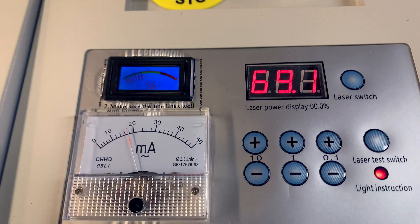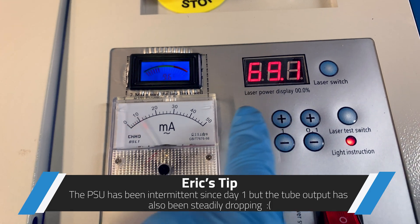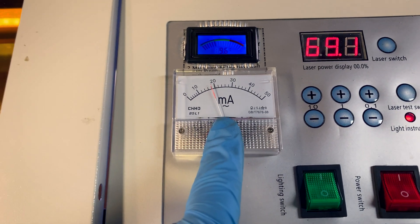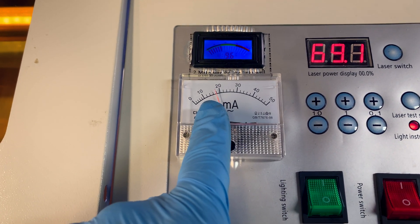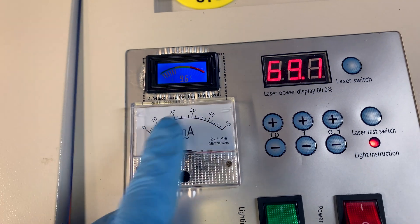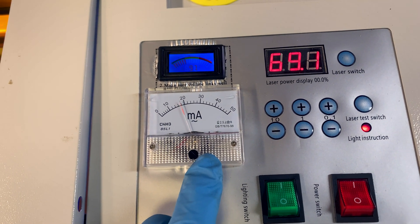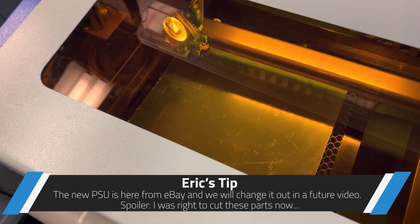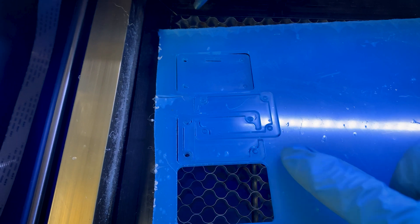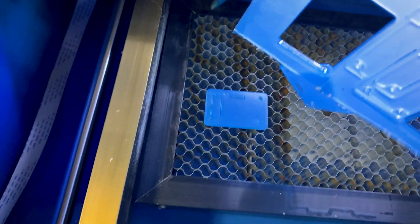This is why I've got to change this power supply right here. We're at max power, pretty much 18 milliamps, but we're at 70%. This is a new controller, and it varies — a couple seconds ago it just conked out and stopped on me, because it just stops. When it stops, the laser just quits firing and you can hear the power supply whine stop. But it's cutting through this time, so I'm going to get the cases I need. This is how things come out of the K40 — they just pop right out, with only the adhesive protection holding them in place.